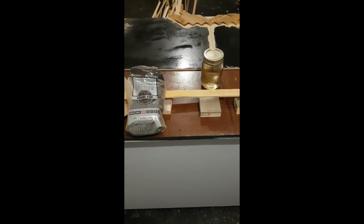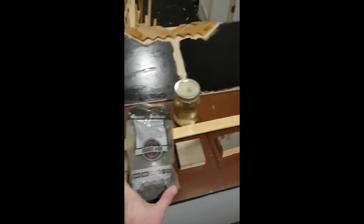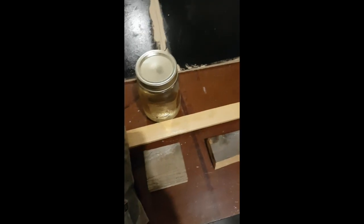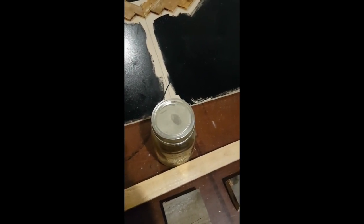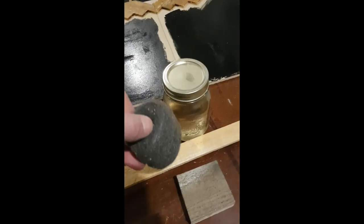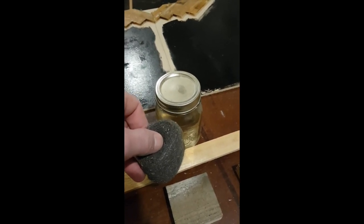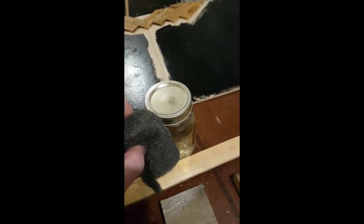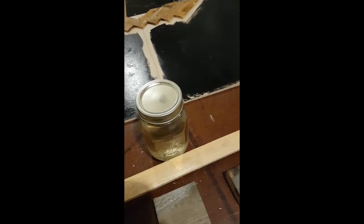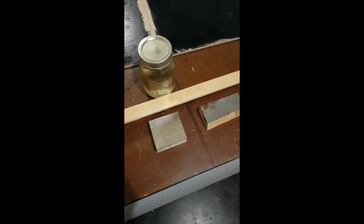I realize I've been talking a lot about the steel wool and vinegar solution, so I'll give you a little more detail on how that's done. I took steel wool — the finer you can get, the better. I had 00, but 000 would have worked as well, maybe even a little bit better. Do not use any SOS pads or anything that might contain soap — make sure you get just the steel wool. I tear this up into small pieces by hand and put it into a mason jar. A glass jar works best so you don't get any interactions. Fill it with vinegar, put the cap on, and let it sit for a week. At the end of the week, just remove the steel wool — I poured it from one jar to another. A glass jar is preferable. And you end up with a very nice weathered look at the end of it.